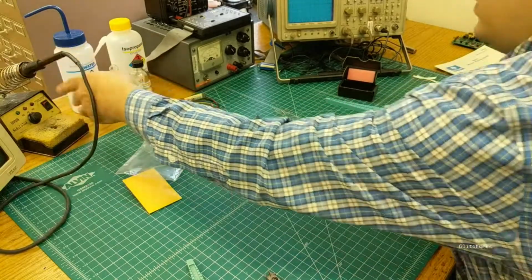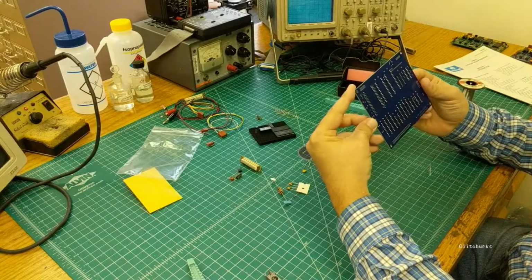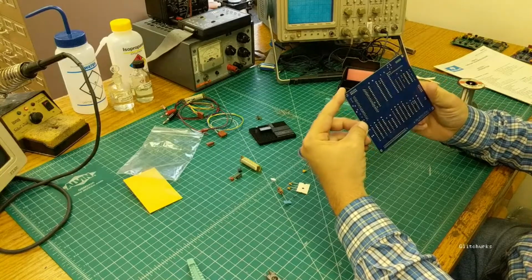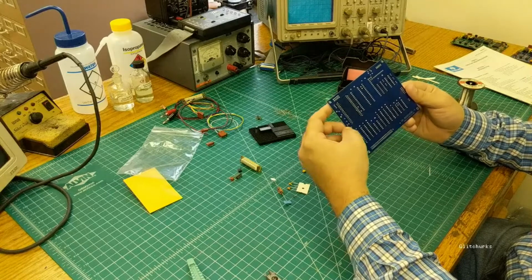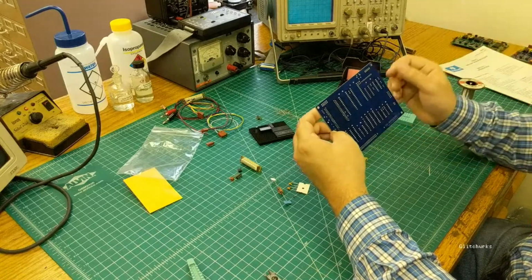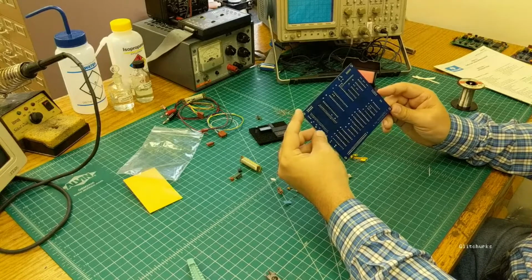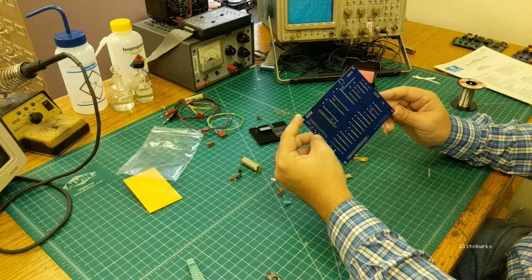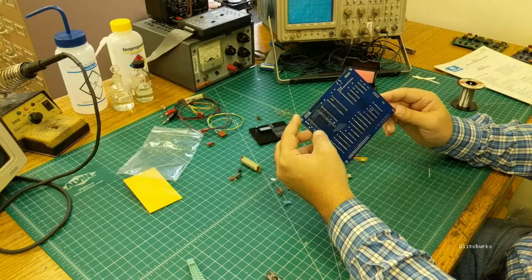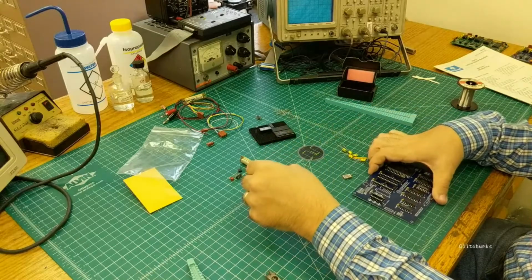Alright, and again you want to check over everything and make sure you don't have any missed joints or any cold solder joints. If you're not familiar with soldering, or you don't have that much experience with it, the user manual links to the Adafruit guide to soldering. We don't really have our own soldering guide up, since plenty of people have that and they probably explained it better than we would. Alright, so that's all your IC sockets and ICs.